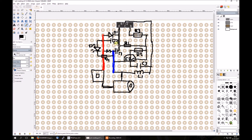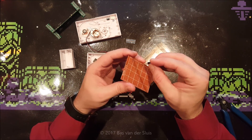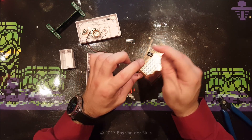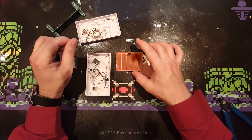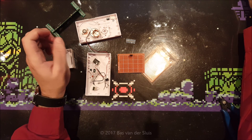So I'm going to push in all the components on the board exactly like this, and then I'm going to make all the connections. Let's switch back to the main camera and start soldering. Let's start by adding the B772 transistor, and I'm going to place it on the top of the board, just like I designed, because if this thing needs a heatsink, I'll have space enough for a heatsink or some aluminium part. And I'm going to add R3 right now, because it needs to be connected to the base of this unit. R3 is 560 ohms.